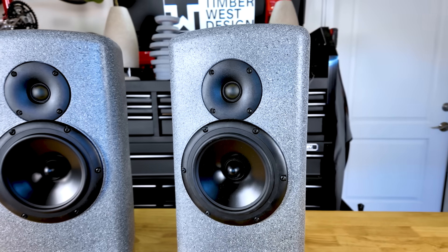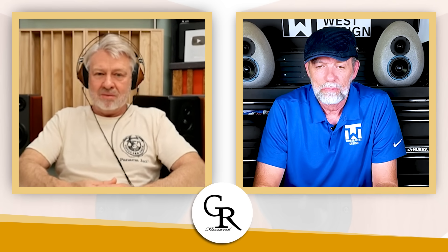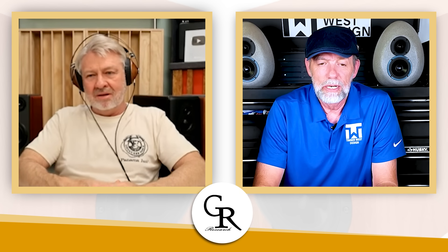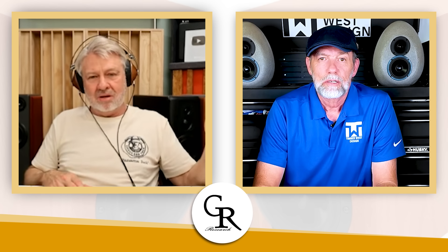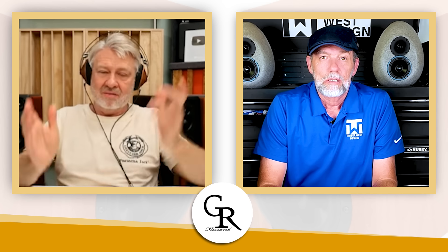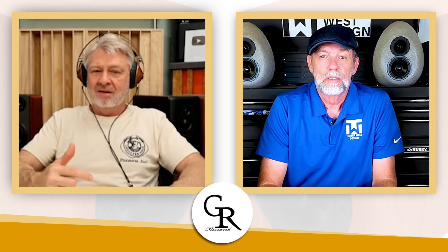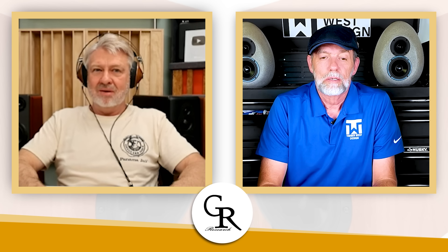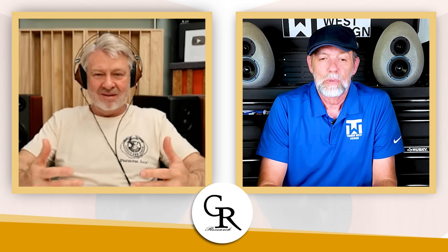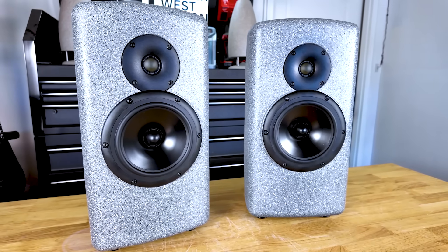It never has to hold that much strength obviously, but the fact that it's that strong and non-resonant really helps — just like the concrete is non-resonant. People don't realize how much coloration comes from the cabinets. I can put an accelerometer on a cabinet and measure how much flex is going on and see that resonance in almost every speaker. You can brace it, add damping material, and control it, but a concrete cabinet has practically nothing. You'd hear exactly what's coming through the driver's diaphragm with no coloration. Most three-quarter-inch speakers that are lightly braced resonate a lot — especially old vintage stuff with no bracing, just flexing like crazy.